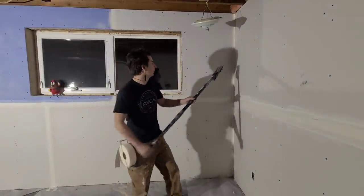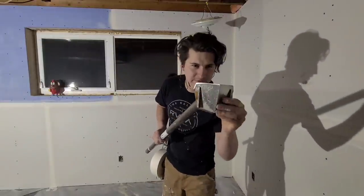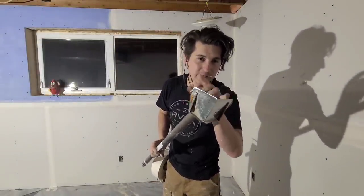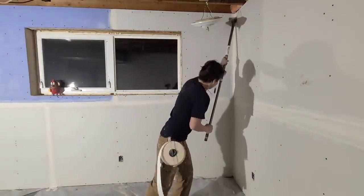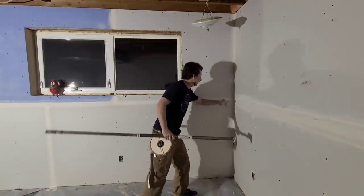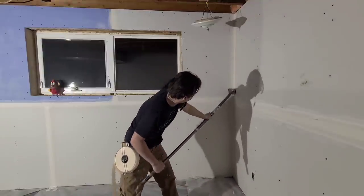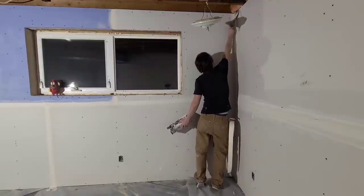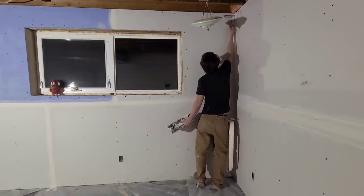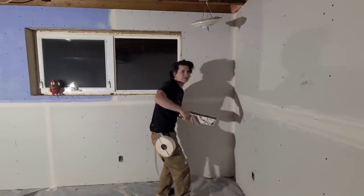Then you use a roller, although this step is optional. Then you take your flusher, and there are different sizes of these. I always just use this 3.5 inch, and then over top, I would use a 4 inch, except it was stolen by one of my old employees. Basically take this, and make sure that when you go over your flat tapes that you don't accidentally rip them off. So you have to ease off as you get to them, then go through it again, and then wipe, because you don't want to have slugs when it comes time to sanding, because it's easier to sand nice and smooth work.